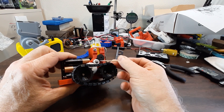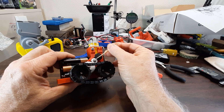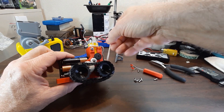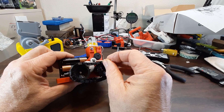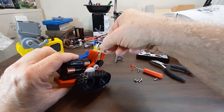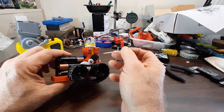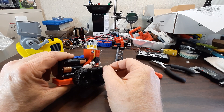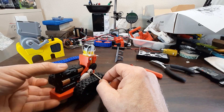This floating pinion requires a little bit of friction right in here between these two gears. When the motor drives it, it will swing this way or that way depending on the motor direction. If it's completely free it may just dance around. To get that little bit of friction, the screw goes through a small o-ring and into this idler lever back here. You want to tighten that up just a little — just enough drag so it pivots with the motor when the motor spins.